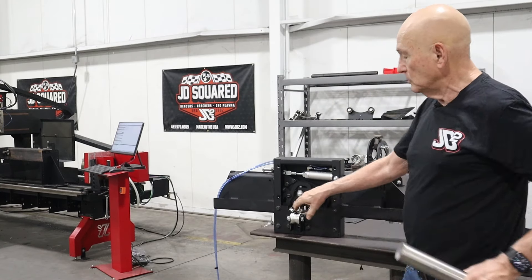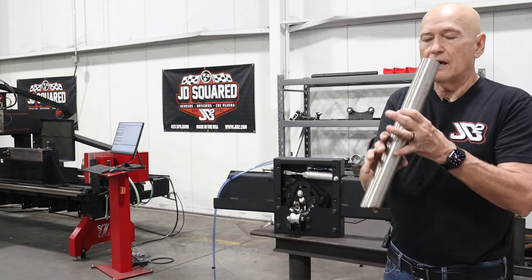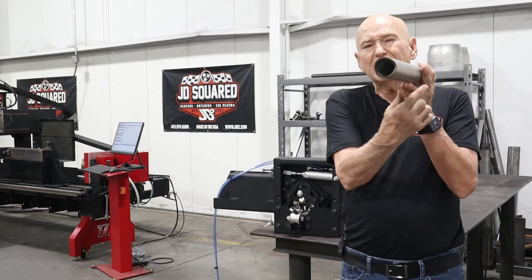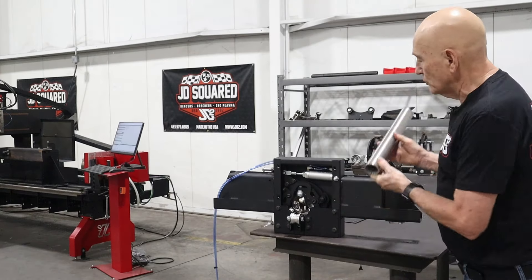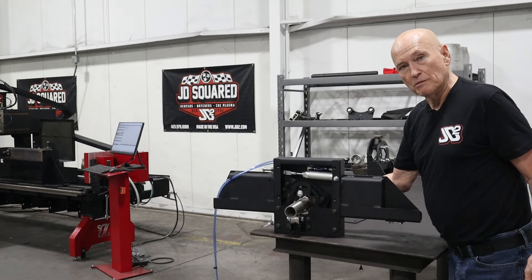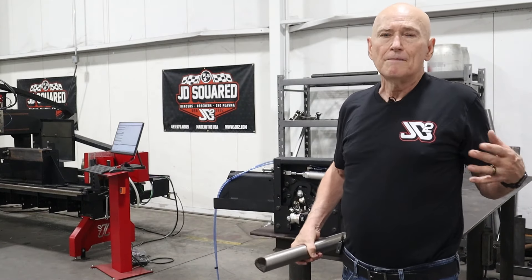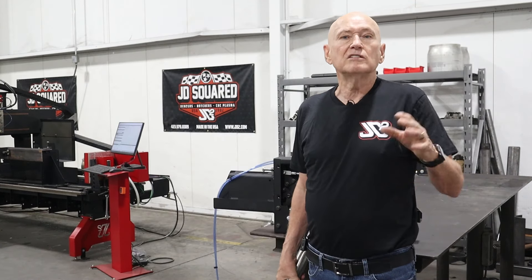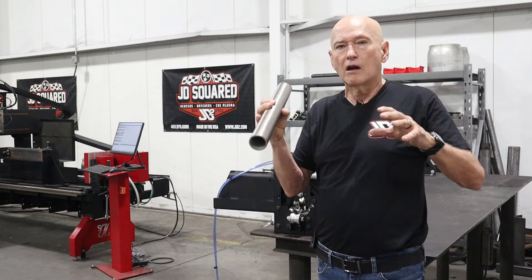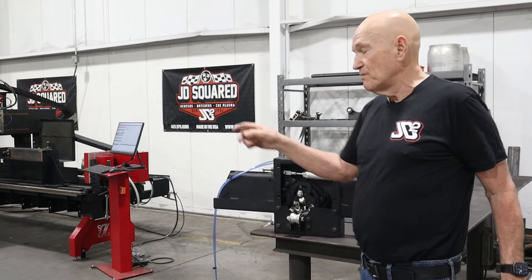You adjust the aluminum roller after you put your workpiece into the machine. You want to adjust it so that it's just below the tube so that when the transfer balls retract, they fall onto that aluminum roller, but not a very large distance — I'm talking like a millimeter, a sixteenth of an inch or something like that. So it's a very small amount that they will drop down, and that will allow us to go full speed.